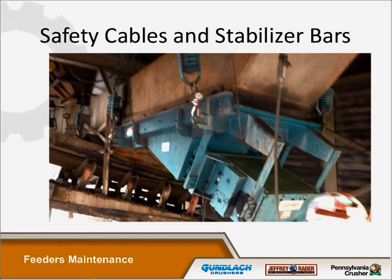This is an example of safety cables on a typical feeder. The stabilizer bar comes down from the feeder and supports the exciter box at four attachment points. These safety cables are there in case something happens and the springs break loose or metal fatigues — so that the feeder doesn't hit the floor. This feeder has been installed at a slightly incorrect angle relative to the support springs, but in this application it's doing exactly what they want it to do — not ideal, but functional.